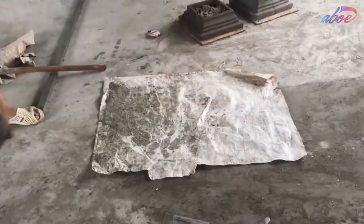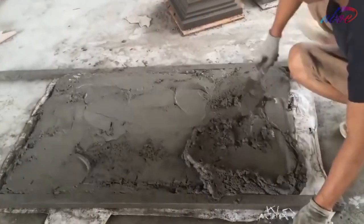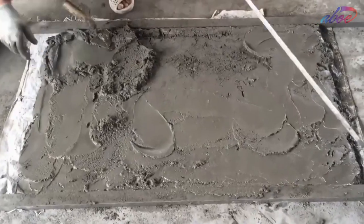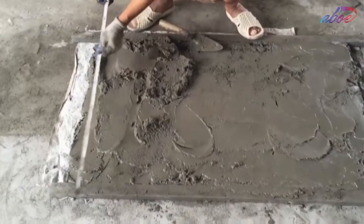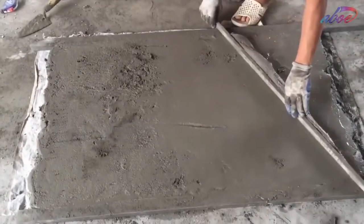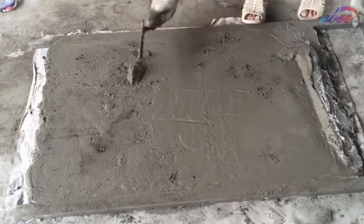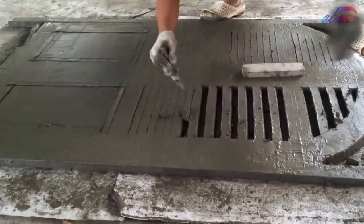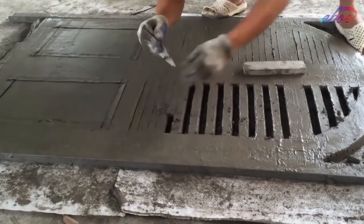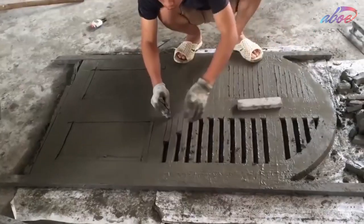The future door's surface is eventually smoothed with the aid of a spatula. The finalized product's surface will include horizontal apertures that resemble a grid in order to measure their breadth and identify their placement. When the future door is marked, the worker uses the same metal bar with trowels to remove the unnecessary concrete slabs. To do so, the surface of the still wet concrete is cut exactly along the marks. The cut pieces are raised up with a knife and then simply removed and dragged aside.